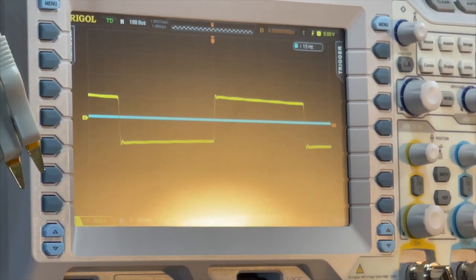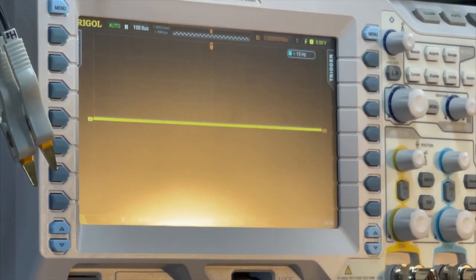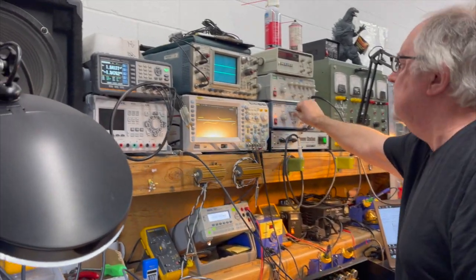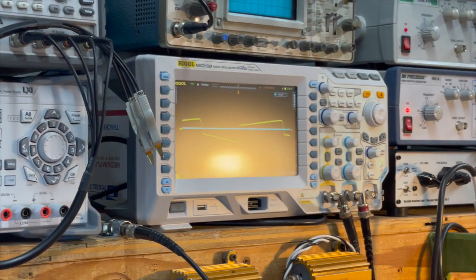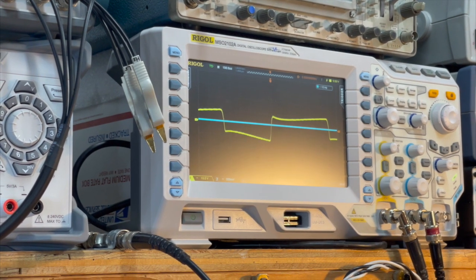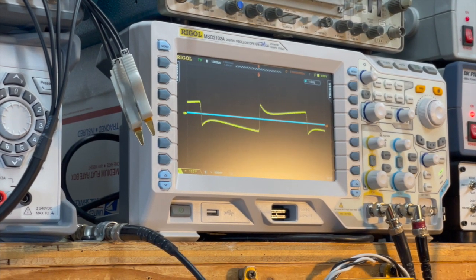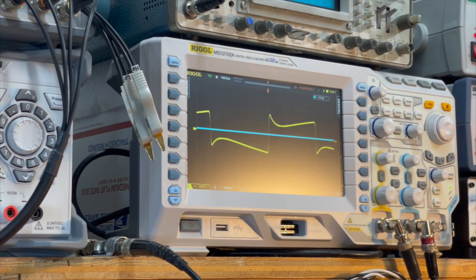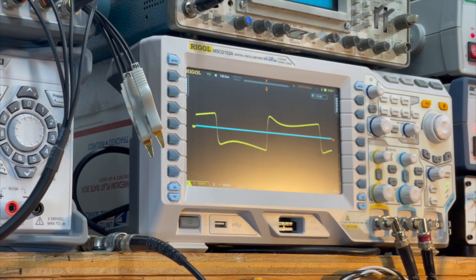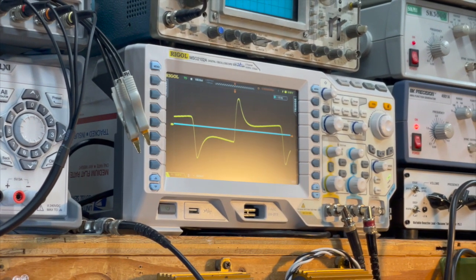So then we go check the square wave response. Here's the presence control. There's the depth control. And then we go into the front of the amp, drop the signal from the function generator way down, because we don't need hardly any gain for that. And we need to be back in the sine wave. And here's the bass control, the middle control, the treble control, and gain boost right there, shift in and out there, additional gain stage there, giving us a real exaggerated square wave, and then same thing on the other channel. Super high gain, regular high gain, boost off, shift off, bass, middle, treble.